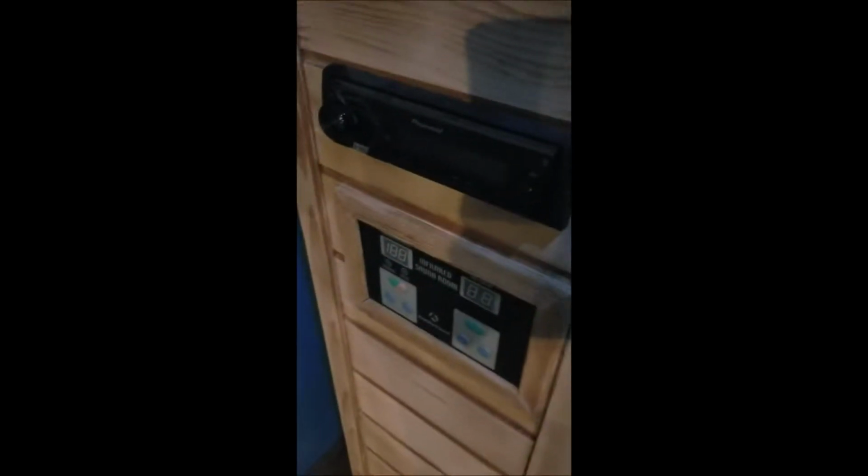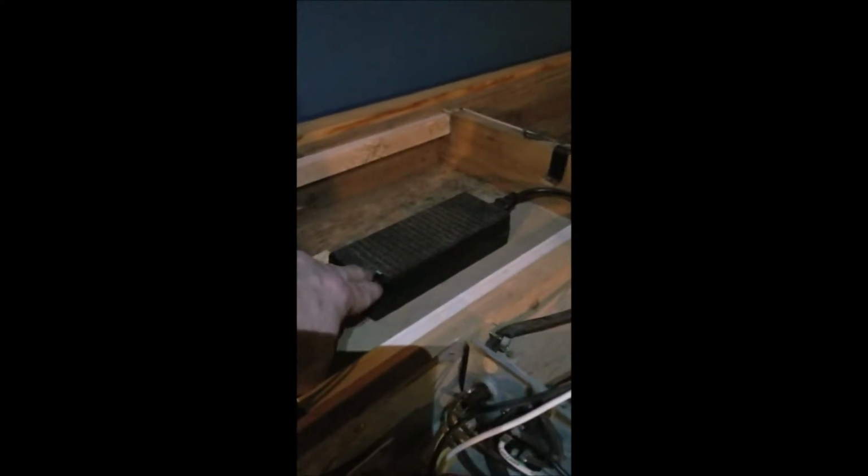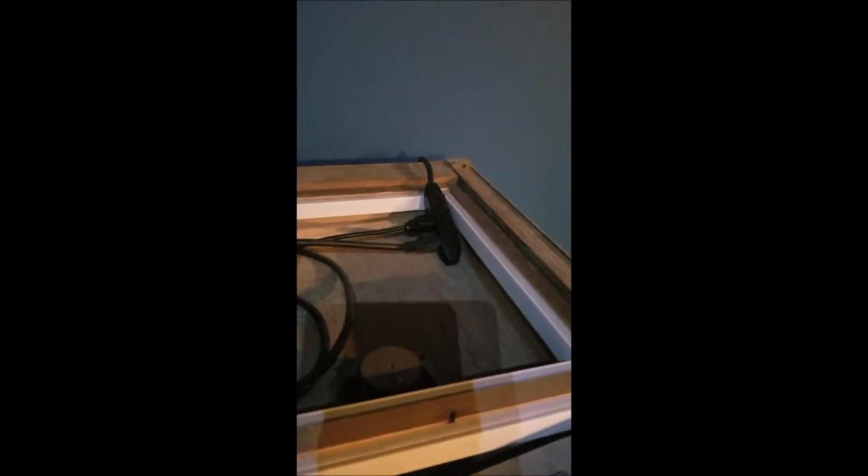But anyway, the problem I was running across is that initially the fan and the stereo and all of those circuits worked. But after a while, I started having problems, like the stereo stopped running. So I had to upgrade the stereo system, and I installed a 12-volt pack that basically plugs into the wall. I have it plugged into an extension cord up at the top back corner of the sauna, and I set that up to run the fan and the stereo, because the old power pack, the 12-volt converter, just didn't have enough juice. It could power the light, but that's all it would do.